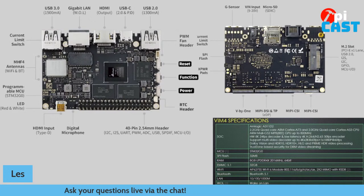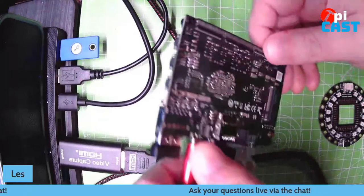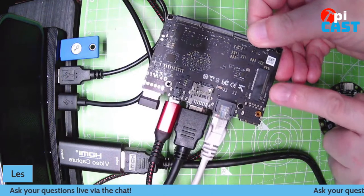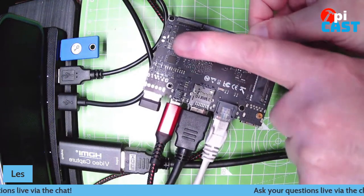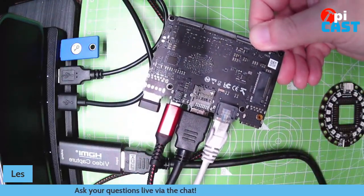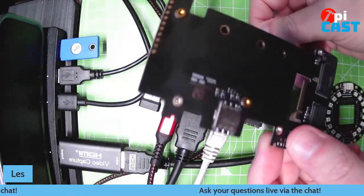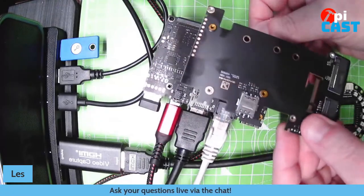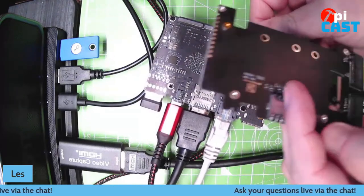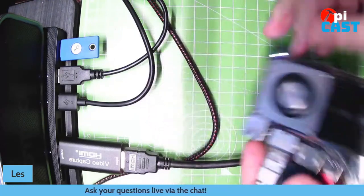I'm going over the camera again so you can see I've flipped this board over. There is a slot for an NVMe there, but notice the orientation of the slot — it's not going this way to put the drive nice and neat on top; it comes away from the board. So you need to get an adapter. Luckily, this is for a VIM 3, which I picked up on Amazon for about £15. This connects onto there and gives me an NVMe 2280 drive slot, and another slot for a 4G card.